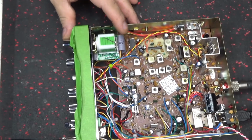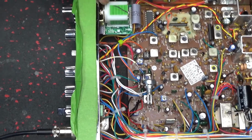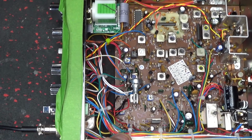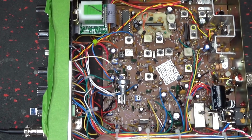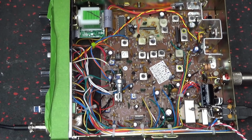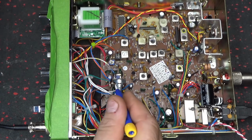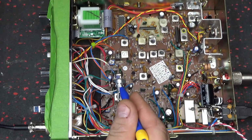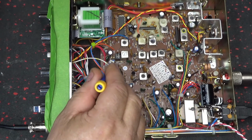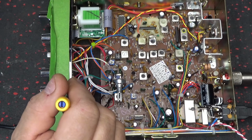I probably get a little bit more out of that if I put a 22 pF cap there. Might try that on a little bit. I don't know. Really, ain't a need to try it. Added a diode here for protection, so if I hook it up backwards, which is going to be here on the table. The Delta Tune was took out of it, and I just soldered it right there to that pot. That I used right around 1,000 ohms.